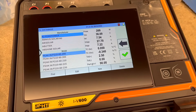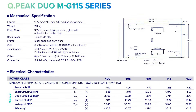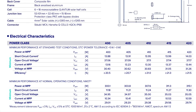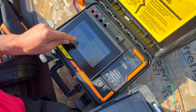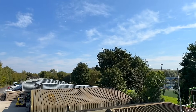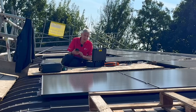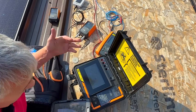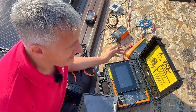I'm inputting the solar panels we've got installed. This unit has an immense database of solar panels, but — typical of our luck on this job — the ones we're using aren't in there. So I've found the datasheet on the website and I'm entering the values manually. You can connect the machine to a computer to download the latest database. The display is a step up from the PV Checks Pro — nice and clear, easy to read, well backlit even on a sunny day. There's a new parameter: 'Perf Year 1', which relates to performance after year one. You also have to set the minimum irradiance threshold — the default is 600, but a more realistic minimum here in Skipton would be 100.